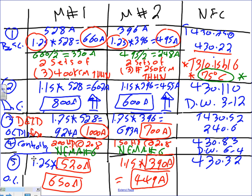So Ashley, my friend, I can't emphasize enough, highlight, guys, when you multiply the nameplate, not the code full load current. Why? Anybody knows why? Because overload is the single most important protection for a system. Because most of the problem with this system, guys, is overloading it. The bearings are not working, it gets overloaded. It gets hot, it gets overloaded. So to protect the motor, they want to depend on what the manufacturer is telling you this motor is loading, not what a bunch of engineers and electricians giving you a hypothetical number from point A to point B. Here's the range. So the exact number. This is an exact number from the nameplate, manufacturer driven.